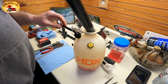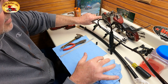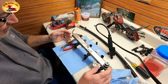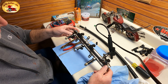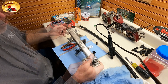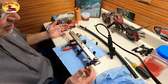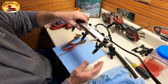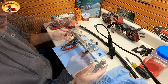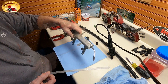We're going to put the plunger back in. I knew there was a way to build one of these cleaning systems to be able to clean all your injectors at the same time — or one at a time if you don't want to do them all at once in the rail. I'll show you how you do that, but this is the simplest: have it all done at one time, touch the wire on each injector with a nine-volt battery, and run it for about 20 to 30 seconds. You can rig up a way to mount this so you're spraying into a container — there are so many ways to build this thing.